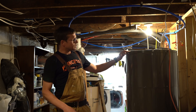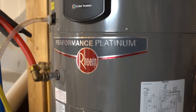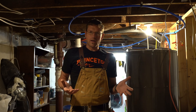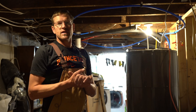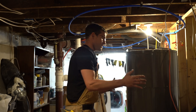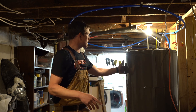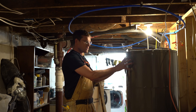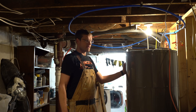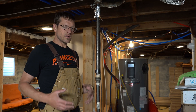Something a little easier to consider is a heat pump water heater. My water heater failed about three years ago, so I purchased a new heat pump water heater — the most efficient type you can get. It heats water with about half the energy of a standard electric water heater, because instead of all the electricity going directly into the tank, the heat pump uses a clever cycle to pull heat out of the air. With just one unit of energy input, I get two or three units of heat into the tank.